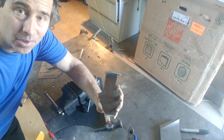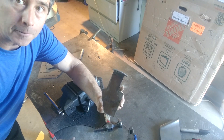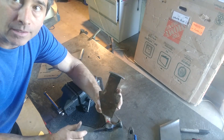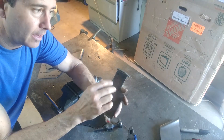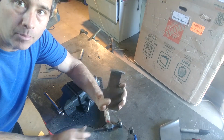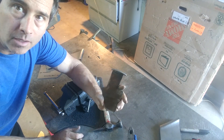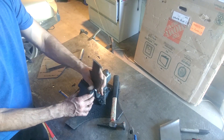Here's another homemade tool that is invaluable. I'm going to use this one for taking out those hammer marks in that flange. It's really just a flat piece of sheet metal with a solid round bar welded on top. There's a little bit of curvature, and what I do is put this in my vise.